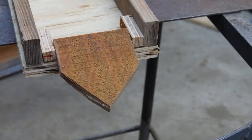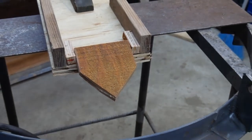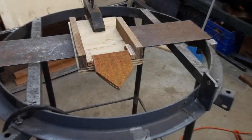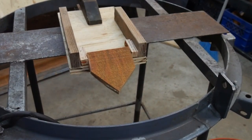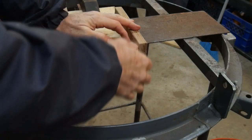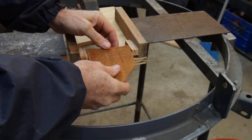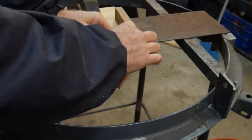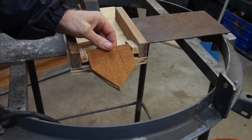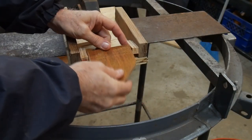Sometimes it's just worthwhile to model something up – in this case, the front of the snowplow. I had in my mind how I was doing this mechanism with these links out here with the dual articulation, which would allow it to rack a little bit under control. And there'll be some mechanisms over the top of each one of these that allow me to adjust the relationship between this and this in terms of angle.